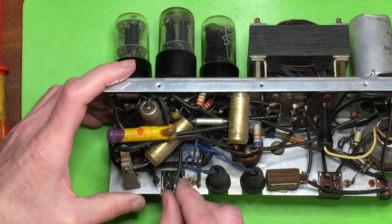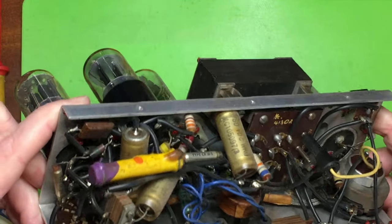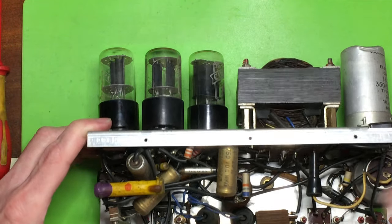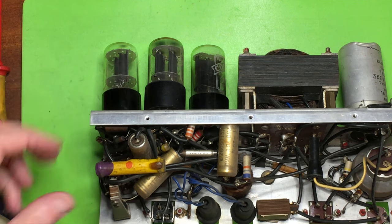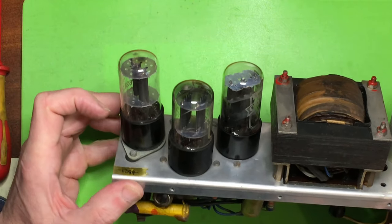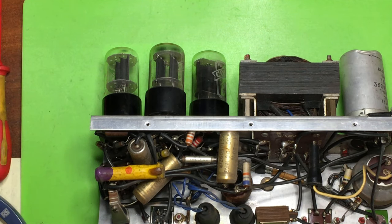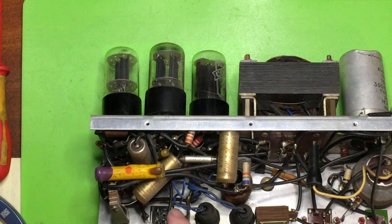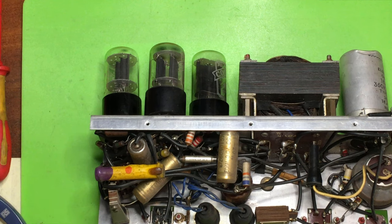I believe that is the chassis ground. It goes direct to one of the valve pins on there, and only from after the valve pin does it go to a terminal tag somewhere up here, the back of that screw, for the actual chassis ground. So they're avoiding any pickup or ground loops. It's almost a semi-differential circuit, although it is grounded. The first thing it connects to is the valve pin. So the signal between the two wires is applied directly to the valve when it's in record.